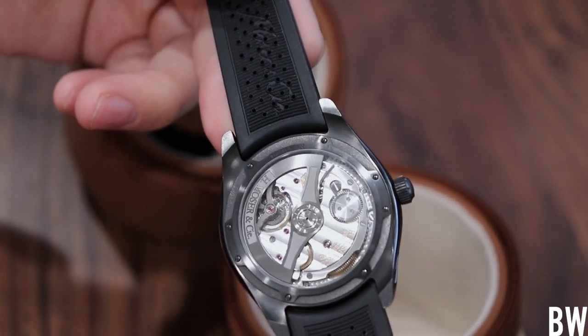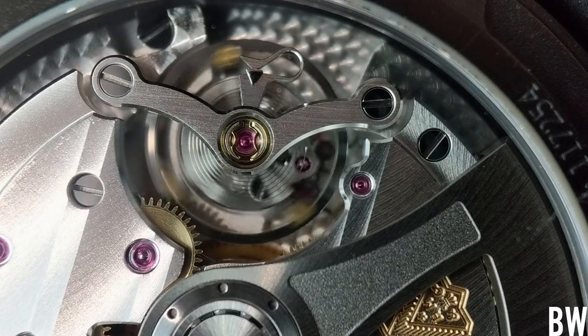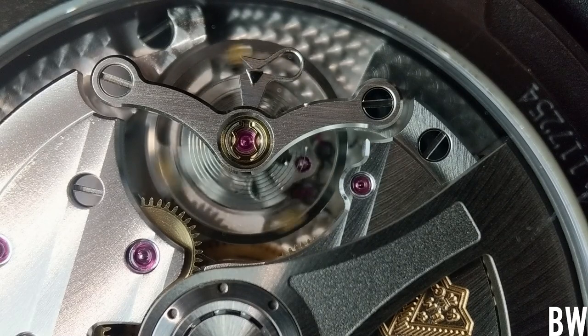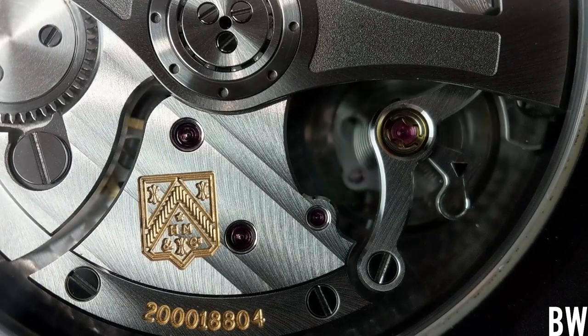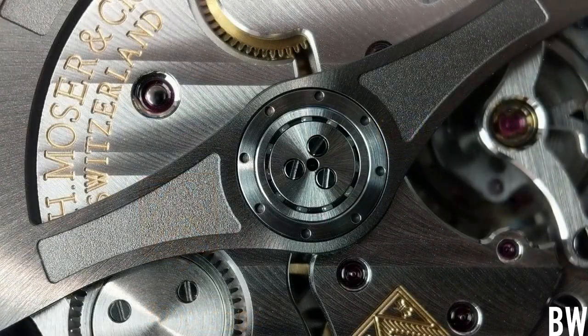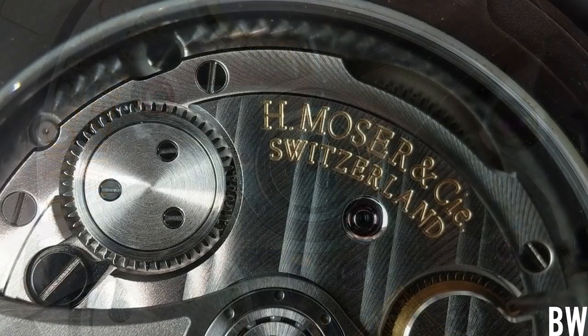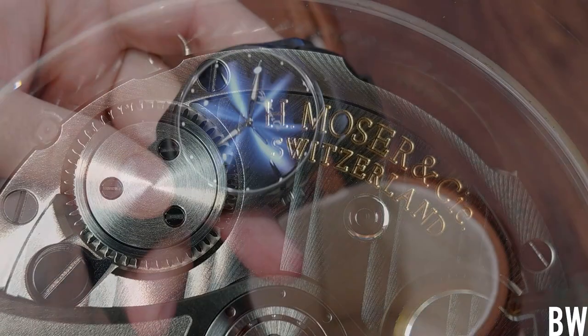This is the HMC 200 caliber — 27 jewels, a 3 Hz beat frequency, 72 hours of power reserve, and an 18-carat gold rotor that really matches the gunmetal tone of the case to a very pleasing degree. The finishing is very impressive and sharp. I love the micro-perlage work. There's an interesting striping that's not uniform in width — you have a long section, then a half section, alternating — and it looks really nice. The finish work on the movement is very good. I like the architecture: the free-sprung balance, the lack of blue screws with black-polished elements instead, and the engraving. This is a fun piece and I'm going to enjoy wearing it and posting a few shots on Instagram.